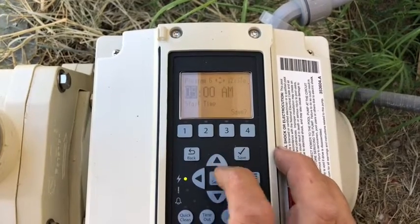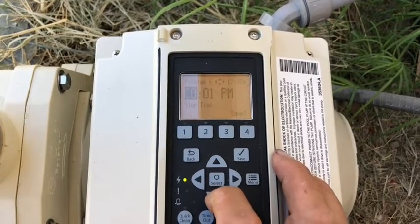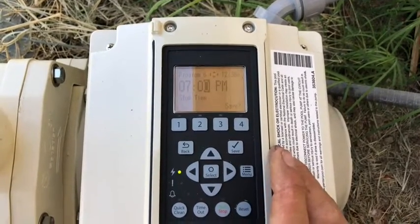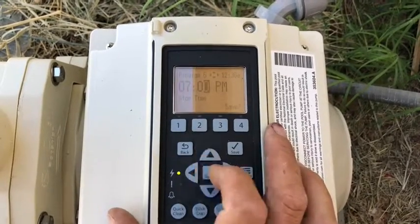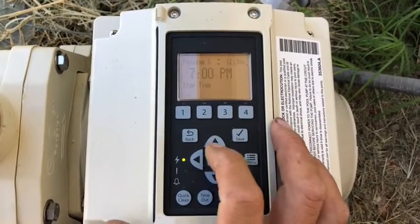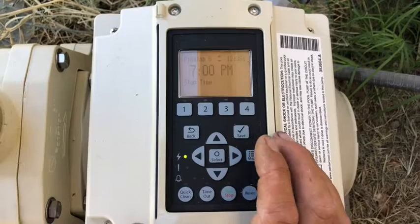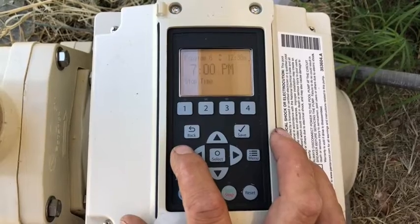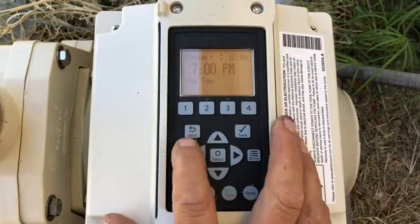Now we'll set our runtime: select, running from about 5 a.m. to 7 p.m. The reason for that is I'm putting this thing shutting off at low speed close to sunset here in Arizona summertime. During daylight this thing is just moving water at a good slow pace — keeping things circulating, keeping water chemistry balanced, keeping temperature uniform throughout the pool throughout the day. That really helps, reduces costs. Even though it's running during prime time it uses so little electricity — less than 100 watts — that it almost doesn't matter.